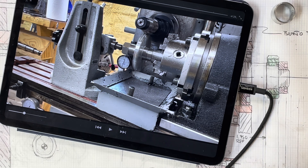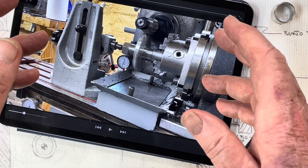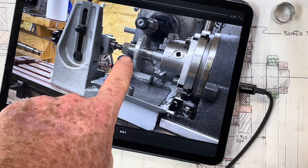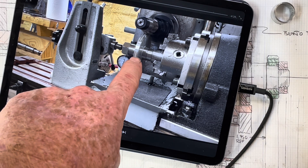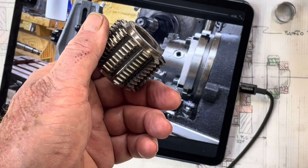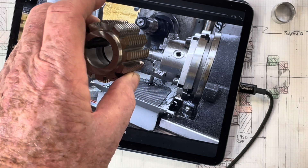Basically, most worm gears are a form of helical gear that you cut without compensating for the helix angle. So the first thing to note about the setup is that you have to take the table angle - that would normally correct for the lead angle on the hob - back to zero. You want the true lead or true helix of the hob to appear in the gear form. There's going to be a very slight, like a degree and a half, helix with this gear. This is an M1 or Mod 1 hob.